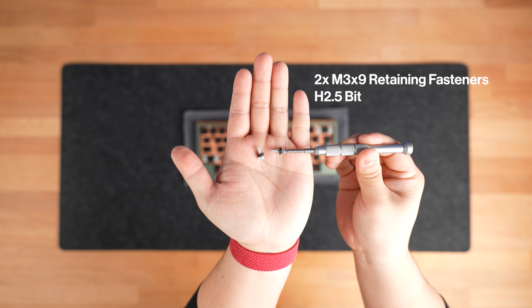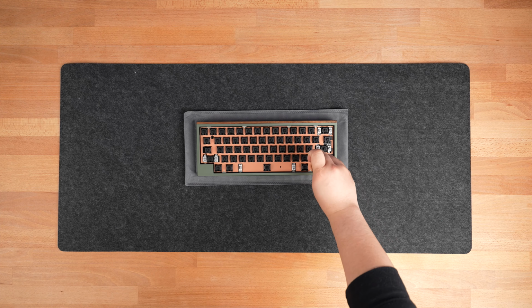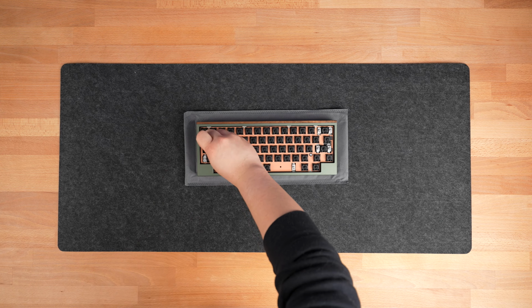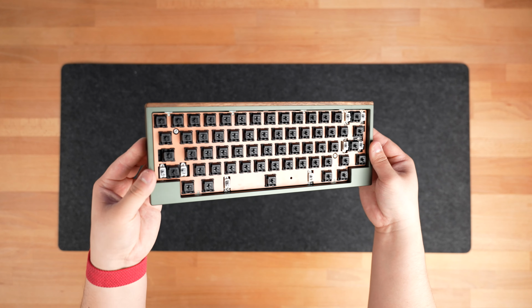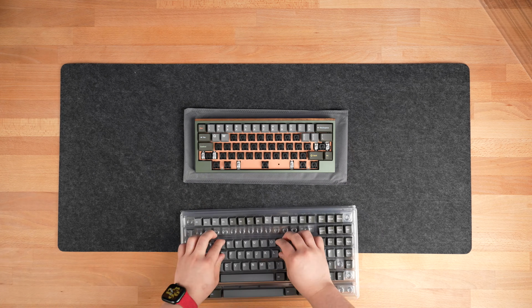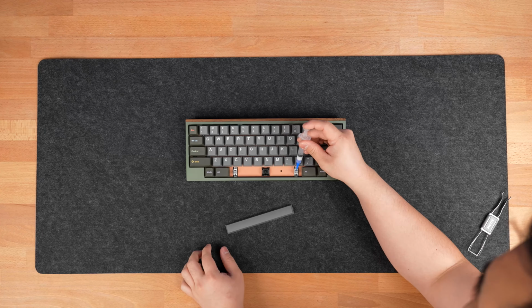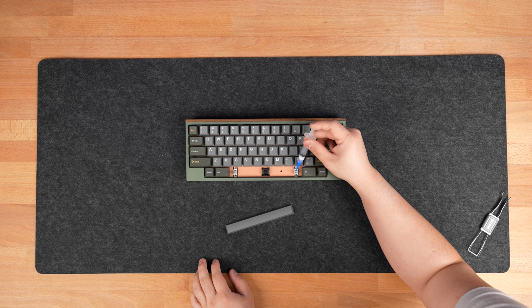Secure the assembly to the chassis using the 2 M3x9 retaining fasteners with the rubber washers. These fasteners prevent the PCB and plate assembly from falling out of the keyboard when it is tipped over. We recommend keeping these very loosely installed to retain maximum flexibility. And finally, install your keycaps and check for any ticking on your stabilizers. If needed, tune your stabilizers by using a lubricant syringe to inject some Krytox 205G0 into the rear of the housing as needed. Be careful not to overdo it and use just a little bit of lube at a time. Again, we'll also leave a link to a great stabilizer tuning tutorial in the description down below.